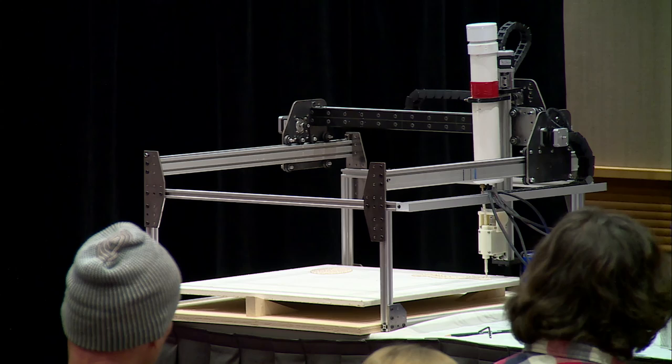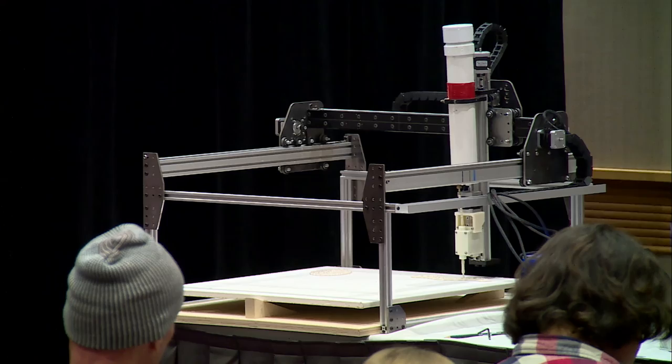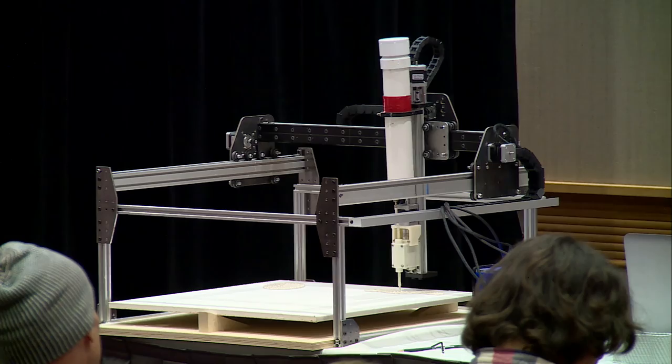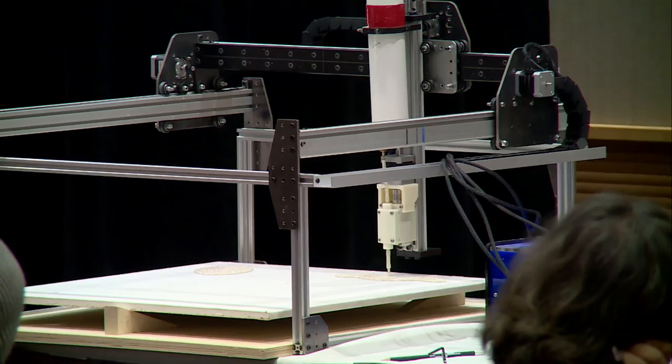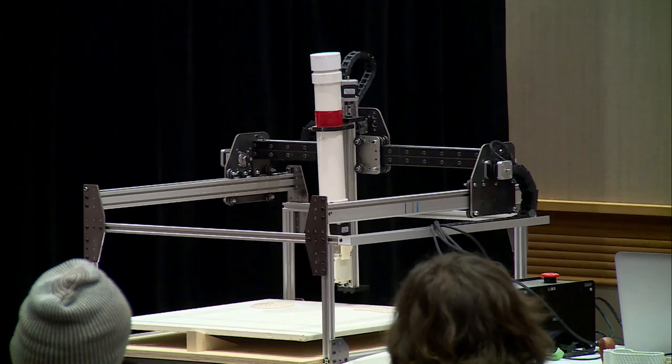There are enough people doing high-resolution printing. I can't wrestle with the big dogs when it comes to financing that kind of equipment, so I'm fine with the lower resolution. Since the recipe is inherently non-plastic with very little clay, there's not much time for handling — you just need to get it in the kiln. It's like a glaze recipe — about 15% clay and the rest is non-plastics.